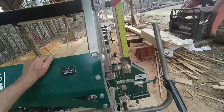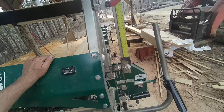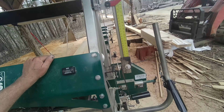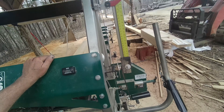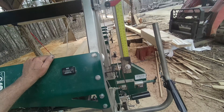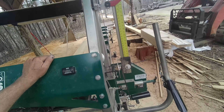I'm actually cutting three beams at once while people using their skill saw are making two or three cuts each time. So even if I have a slight discrepancy in height — like this one's an eighth of an inch smaller — by cutting it with my saw and measuring it out, you are not going to have any discrepancy in your tenon. It just makes it real easy.